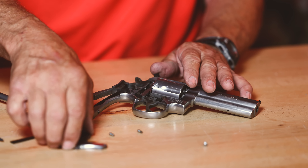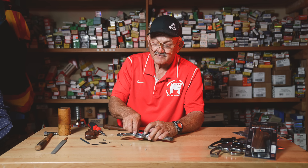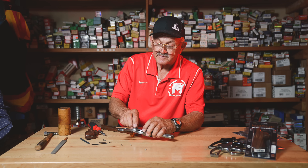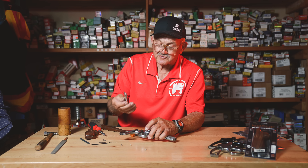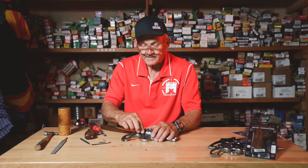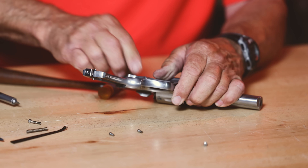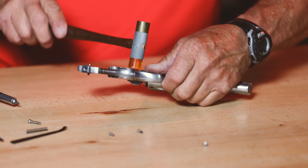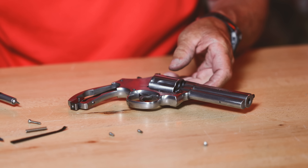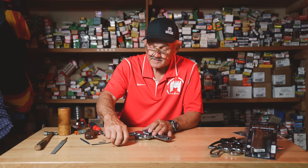You can put a little oil in there if you want. With the safety bar, put it in and push it all the way to the front and top — that makes the side plate go on a lot easier. Place the side plate on, with the two spots forward of the side plate on top, and tap it gently with the soft-faced hammer. The safety bar must be maintained in the upward position; if it falls to the bottom the side plate will not go back on. Hold it up in that position and tap it in.